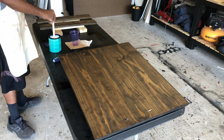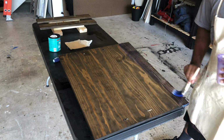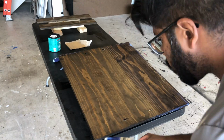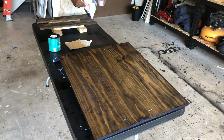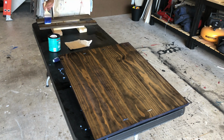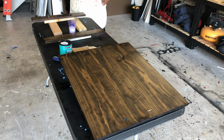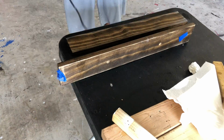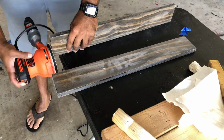When doing finishing work like staining and adding clear coat, it's very important to take your sweet time, go slow and easy, sanding in between each stage, making sure everything is properly cleaned before you add another coat. The last thing you want to do is trap dust in polyurethane. After the first coat dried and cured, it was a quick sand followed by a second coat.